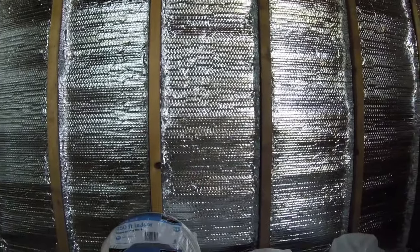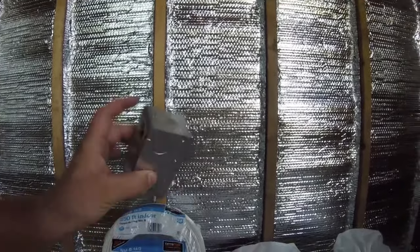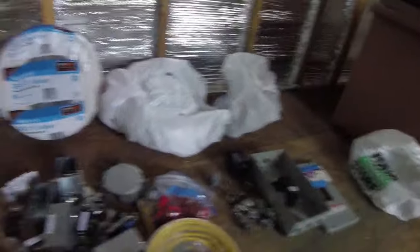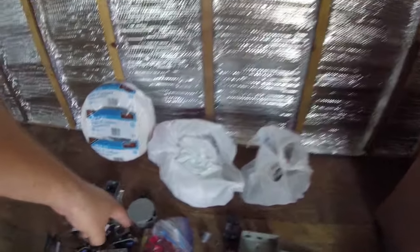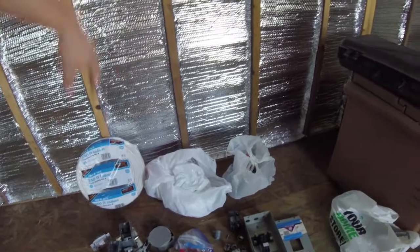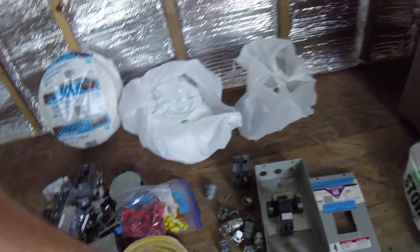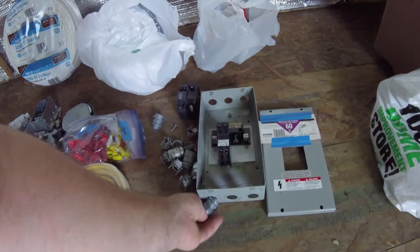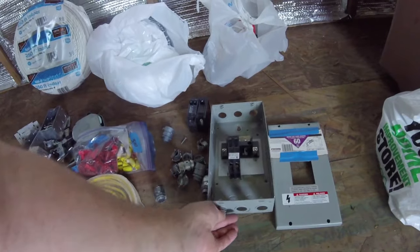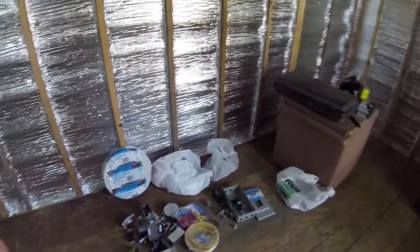The ground wire feeds through the box, then continues to hook onto the plug. That's one little detail I learned. I also learned about how to pigtail some wires in case one's going to go to another switch or plug or another line out. I also bought some wire holders so the wire doesn't yank out of the box. Those were things that narrowed down in my mind — because looking on the shelf I saw a bunch of stuff and didn't know where to start. I looked at the shelf for an hour.